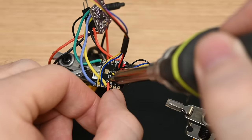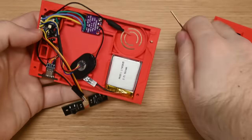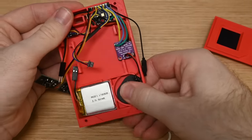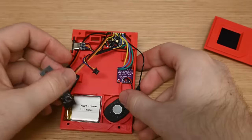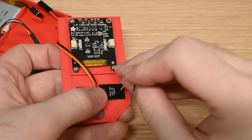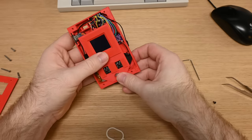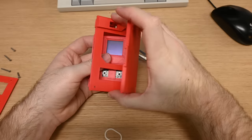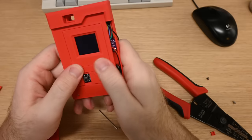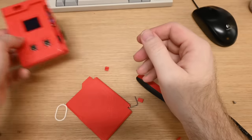I did some other soldering, including leads for the battery and the USB port. Then I started mounting things in the actual case. I decided to switch speakers — this one's a little lower profile, sounds about the same, so that's going to save us some room. It's also sticky, which is convenient for us. Off camera, I also soldered up the two buttons on the breakouts. So now we can mount those in their spot and we'll end up with nice little clicky buttons. Everything is sitting pretty well, so we can actually try to close the case for the first time. I had to make a couple tweaks, but it feels pretty good — it closes and everything lines up well. I'll replace the bezel with the right color and put the door back on off screen. But for the moment, let's talk about the software.